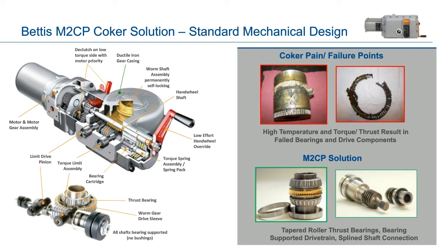Anti-friction bearings are used throughout the entire power transmission gear train. Sensing of position and torque in the M2CP is purely mechanical, with drives connected directly to the worm shaft, providing accurate and reliable feedback into the electronic enclosure. For gate or multi-turn valves, the output drive sleeve is supported top and bottom by tapered roller bearings for supporting axial and radial loads. These robust bearings ensure that valve thrust is contained, resulting in less wear and potential failure of the valve stem bushing — a problem perpetuated by high temperatures and steadily increasing valve torque and thrust over time. Another unique feature of the M2CP design is the handwheel override, which is geared to the worm rather than being directly connected to the valve stem.